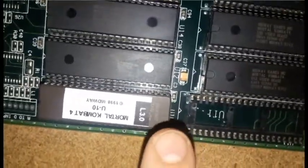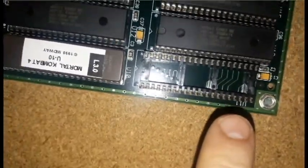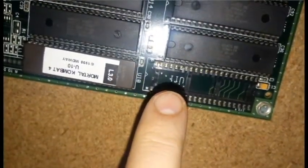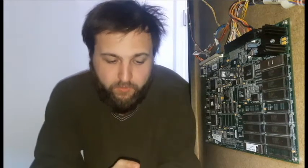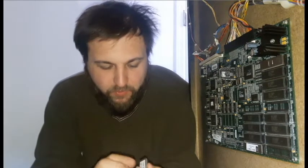The board is labeled here — for example, it says U10 right here, so U10 goes in that way. And as you can see, U11 is labeled here too, and once you pop out the EPROM, it's also printed underneath it. According to the HobbyROMs guy, I shouldn't focus on the sticker — I should focus on these notches for proper orientation.